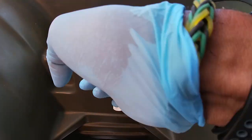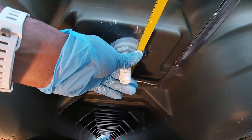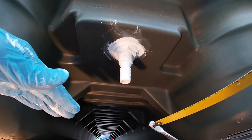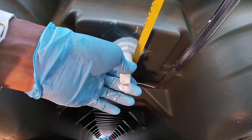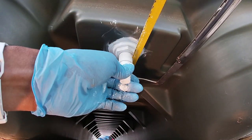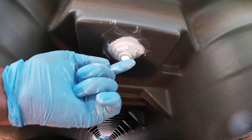I'm adding a bit more sealant all around the edge on the underside — this is the side that'll be underneath the water, so let's get it right. Now I'm cutting off the excess connector with a hacksaw. I want it pretty close to the hull of the boat so draining is easy — whether I'm in the lake, at the boat ramp, or cleaning. I'll leave about a quarter inch of clearance.